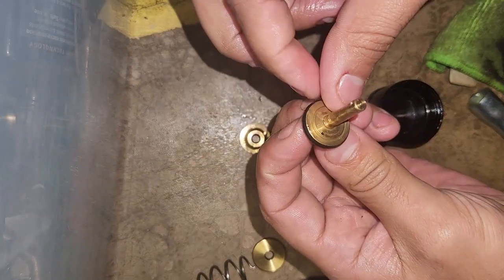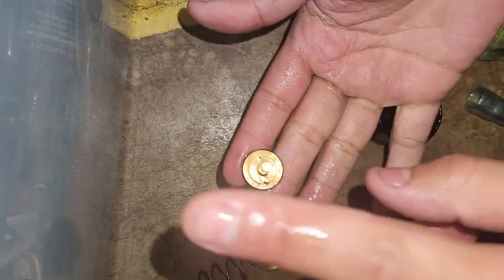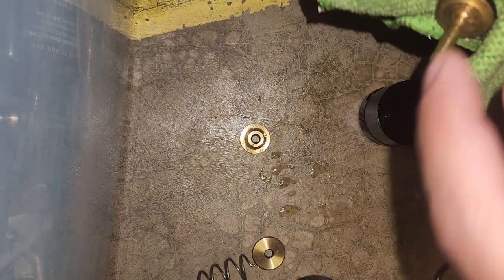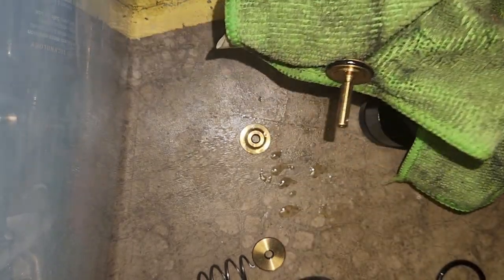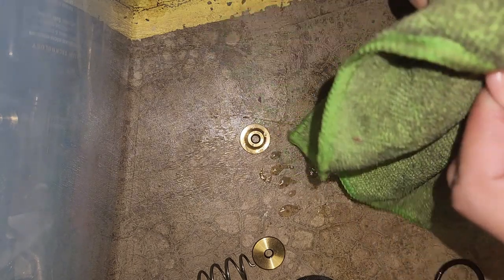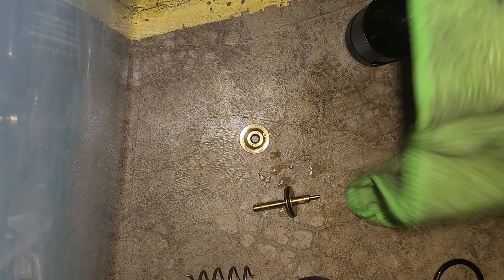This is the bottom plate. This is the piece that I broke — I don't know if it really matters if anybody wants to take it down that far, but this is just pressure fit. If you put this on a vise and strike it downward it should slip out. Be very careful because this piece has a thin section right here where it thins out — that's where mine snapped. It is very very fragile. There's also an O-ring out here, and the bottom piece has an internal O-ring and an external O-ring.